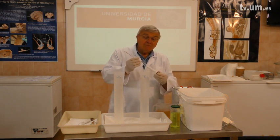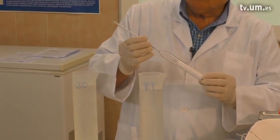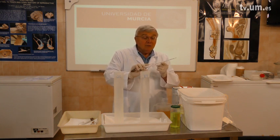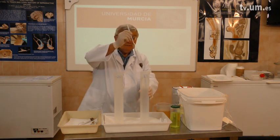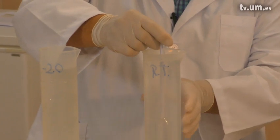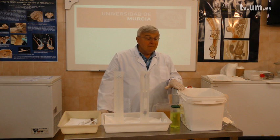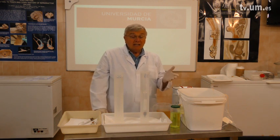We can check the acetone purity by using an acetonometer. The acetonometers are calibrated to a certain temperature — this one is calibrated to 20 degrees centigrade, or room temperature. So we take and put this in the acetone after it's warmed up, and we can get a reading to see what the percent is. It reads about 100%, so we know the acetone is good. We can leave the specimens in here until we're ready to change it in about three days.